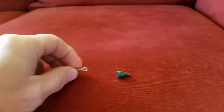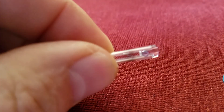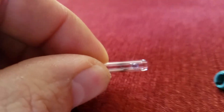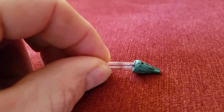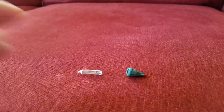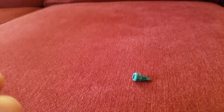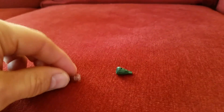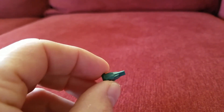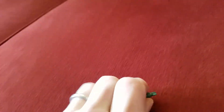There are a bunch of videos out there that talk about shunts — you can see there's a shunt in the bulb. If the bulb had burnt out but was still connected, the shunt would have completed the circuit. But since the bulb was completely disconnected, the shunt was doing nothing. We pulled the bulb out — lights were still off. Then we pulled the base out and the entire strand came on.